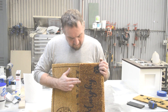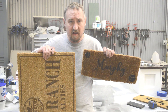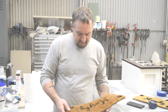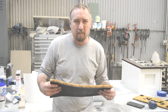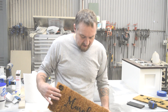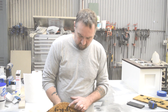I don't think it's damp anymore — I think the borax actually darkened it up. You can tell how big of a difference there is, and there's also a huge difference in the darkness of the laser burn itself. After burning up one mat, I decided it was smarter to laser this a little bit damp — not soaked, just damp. That meant I had to adjust my speed: I left it at 40% power but brought the speed down to 500 millimeters per minute, and I got this nice dark burn.